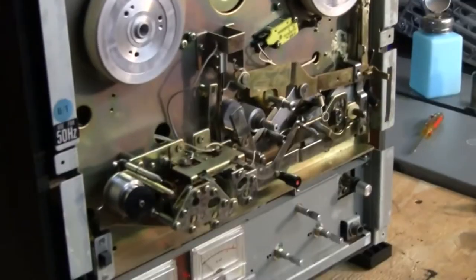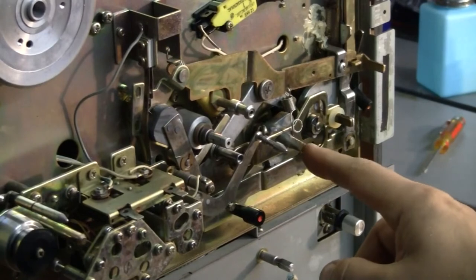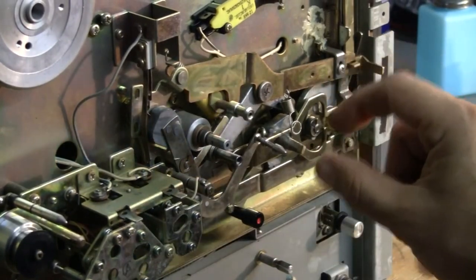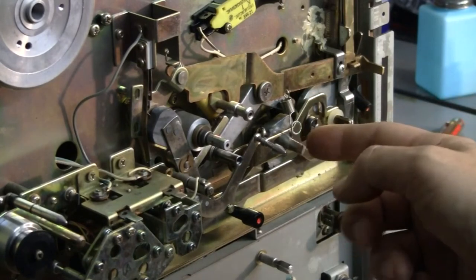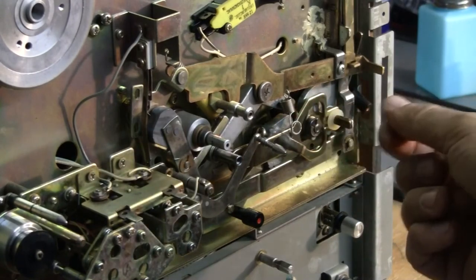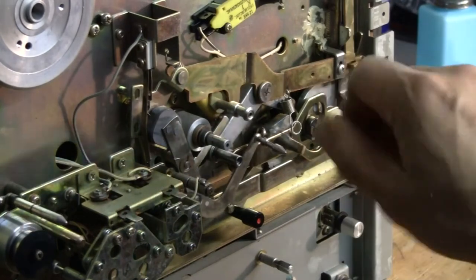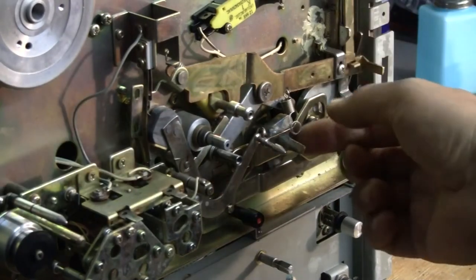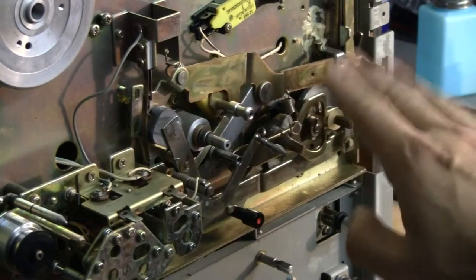All right, here's what's going on. It's looking pretty good. It took me a long time to figure out how I was gonna fix this little knob here. What I did was I made a shaft, put the shaft in, put a piece of brass into that shaft, drilled out a hole between those two. Then I placed a pin through that, and then with some epoxy, made it all together for some added strength. So, still drying. I'm not gonna put the spring on it yet. It'll put tension, so that'll be tomorrow.